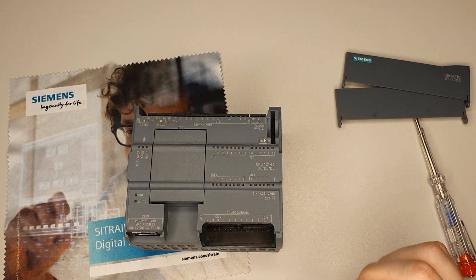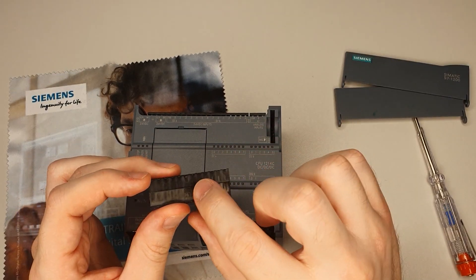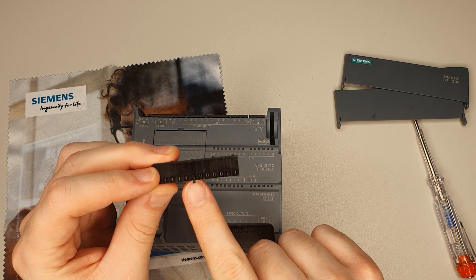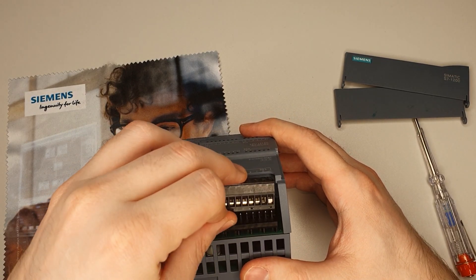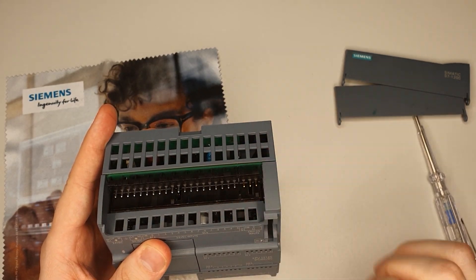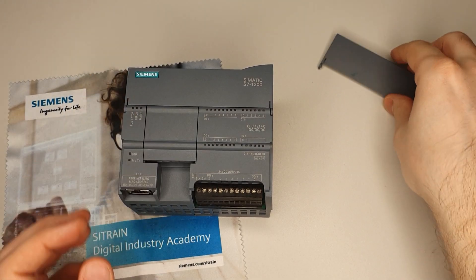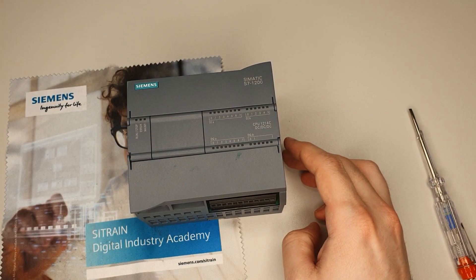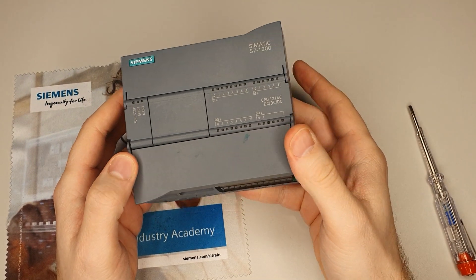I know those pins are broken and I need to get the replacement module with 10 connections to re-solder. I'll pop the cover back on — connected here and here. The plastic parts: the pin connectors terminal slides on here. There's a little fin in the center that goes into a socket, and you just push it in. You shouldn't do this too many times with the plastic because it will bend and could break at some point.